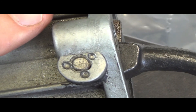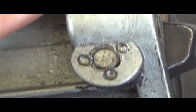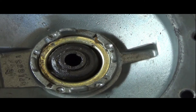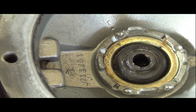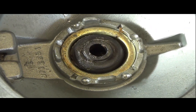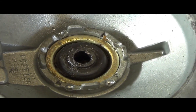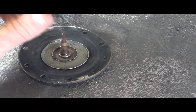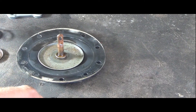Without filing down and flattening off that end, you can't get the retaining clip out to drift that pin out. I also notice on the top of the fuel side there are similar riveted, dented-in areas retaining the oil seal in there. If I want to remove and replace the oil seals, I'll have to do a little metal work. For documentation: there's a spring and a bowl cap coming off the fuel assembly side.